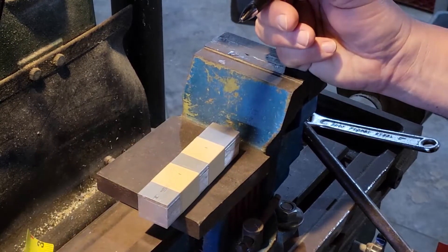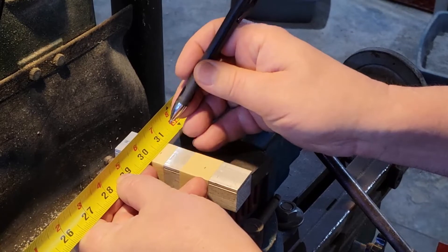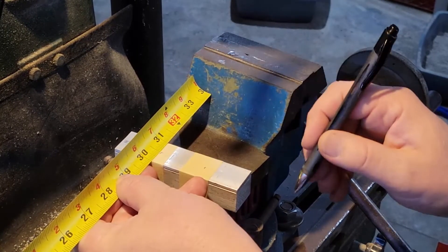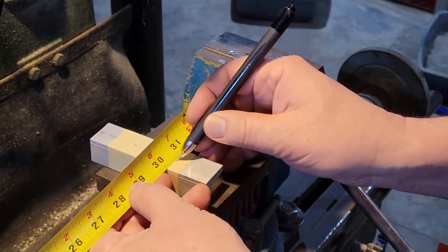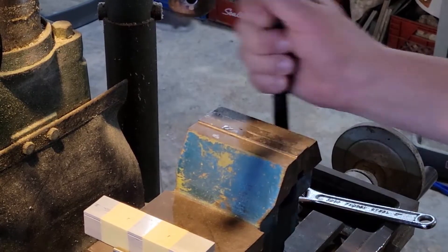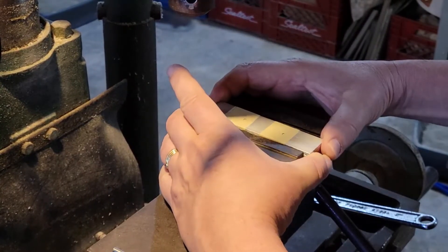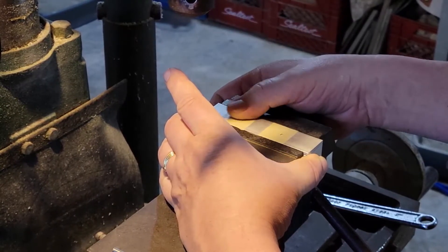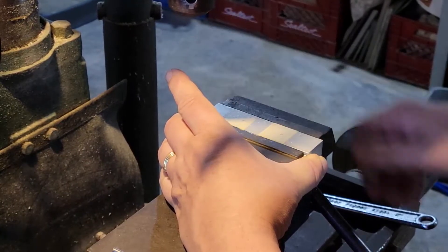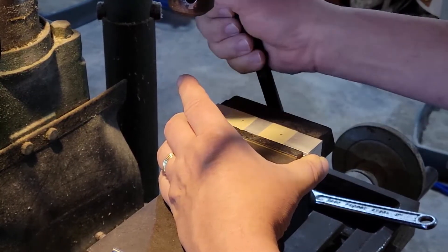I'm going into three-quarter inch bar with a one-eighth inch piece of strapping on top. Masking tape holds it in place and gives me something nice to mark the holes on. Where the holes go isn't really relevant — they just need to firmly keep the sandpaper in place. I need to make sure they're countersunk, because the part against the countertop has to be smooth and the bolts can't stick up beyond that, otherwise I'd end up scratching the countertop.